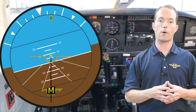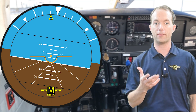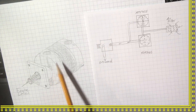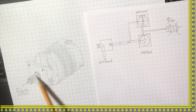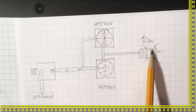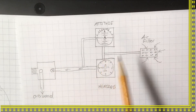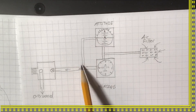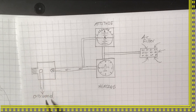There are two ways that you can power a gyroscope: with air or with an electric motor. Typically the attitude indicator is powered by air. An engine-driven vacuum pump with a spline shaft connects to the back of the engine. The vacuum pump sucks in air first through the air filter, then it goes to your vacuum-driven instruments — your attitude indicator and heading indicator — and then it converges back to the vacuum pump and the air gets dumped overboard. The air inlet is positioned near the rim of the gyroscope and it has little teeth so it gets something to grip onto and spins really fast.